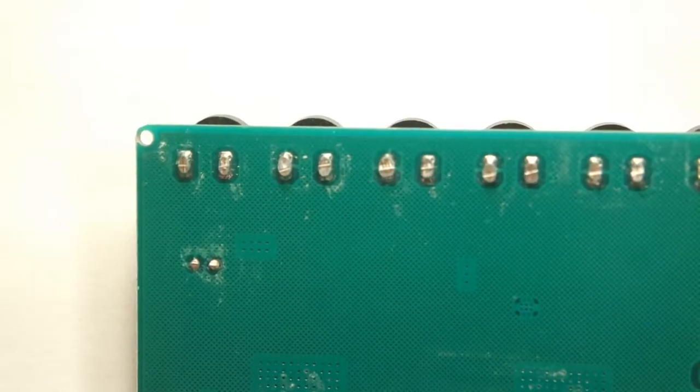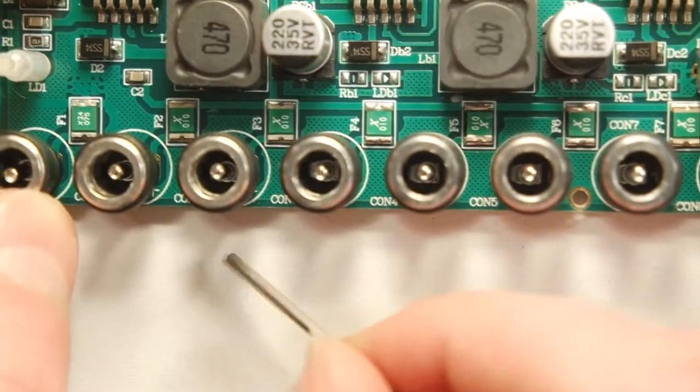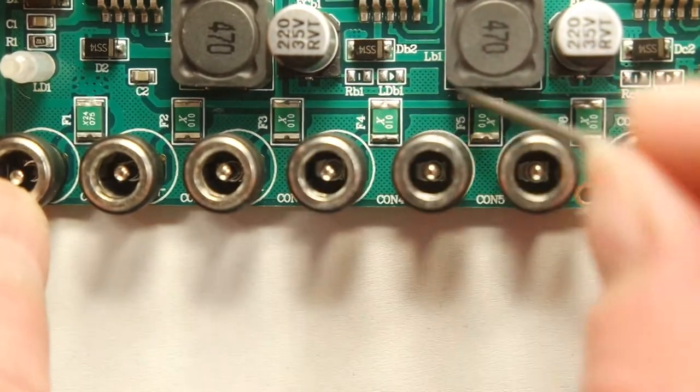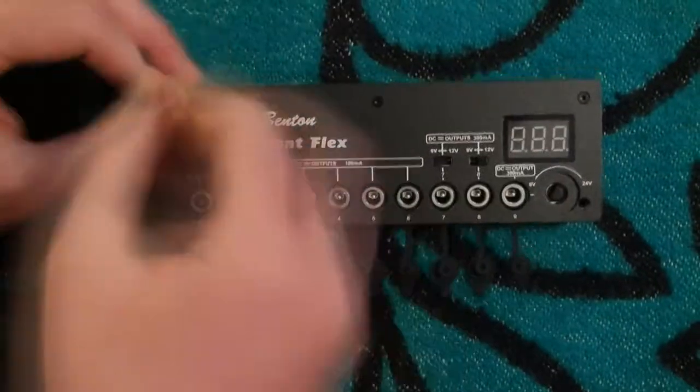And so I might just take it apart as well to look inside. And so, as you can see, all the negative pins share the same ground bus. And as I supposed, all the 9V outputs share the same positive bus, except that all the outputs have their own short circuit protection. And so this might be advanced, but still a daisy chain. So I might just put it together and test how it works.